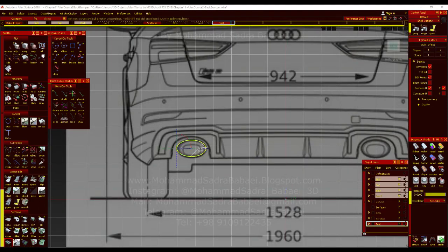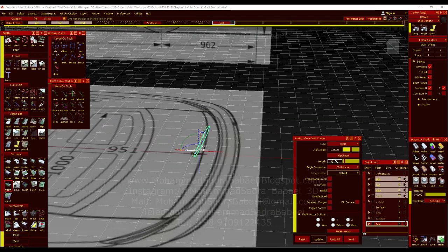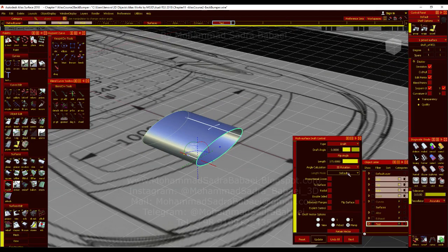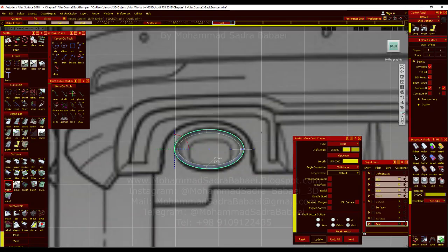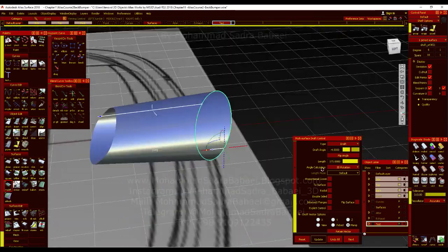Okay. Now we can use the draft tool to draft the surface here. We have our draft value here, the lens, and shading. Again, this is really easy. This is not so hard. Digital design is very easy if you've been in love with this field. Okay, let me just add an angle here. Oh, this is so much. Minus 2.5 is okay. And I can also flip the angle. Minus 3. Or you can add 3 and flip it. Or 4 and flip it. Okay. So you can use this.